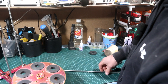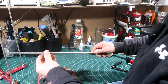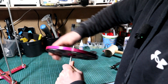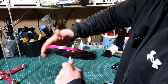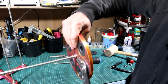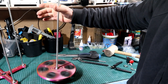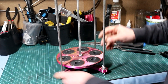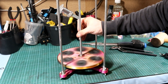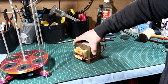After the glue settles, I take a 50 centimeter long threaded rod, 8 millimeters in diameter, and screw it into the 3D model. This gives more stability and reduces vibration. Using an 8 millimeter nut I lock it in place so it doesn't come loose. As you can see the rotor is spinning freely, looks properly balanced, and doesn't wobble.